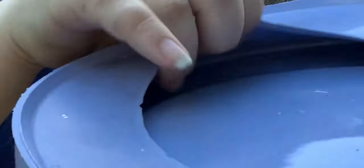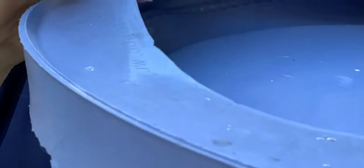So the inside silicone is perfect. There's all those little dots, and all of this is perfect, smooth, beautiful. Using all of the ground up chunks didn't affect it at all. The only place that you can really see them is on the open space where we actually poured our silicone and they didn't settle in. And that's fine, because it's now our bottom. And that is how you can make a silicone mold of any object and use it to cast resin.